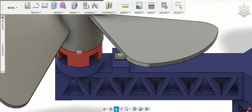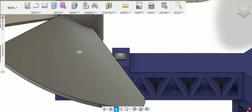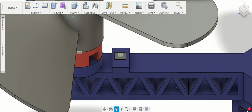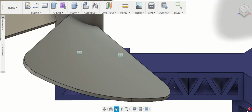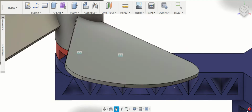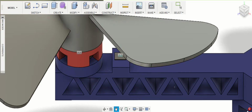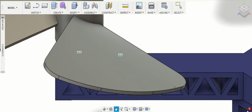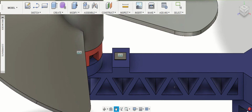And another thing that I built into my design is in the frame. You can see that there are approximately equilateral triangle cutouts along the legs here, and this can promote the aerodynamics of the drone as well as to lighten up the drone by taking away some weight that is unnecessary. And these cutouts also can be used to string through wires that will need to be used to connect the parts of the drone, and by using the legs to string through the wires, we can assure that there will not be interference of these wires with moving parts like propellers.